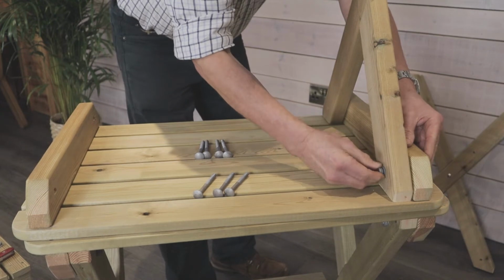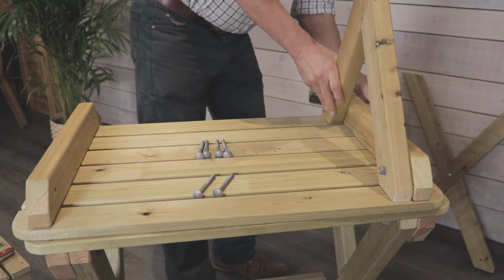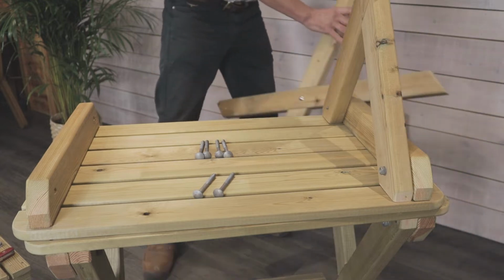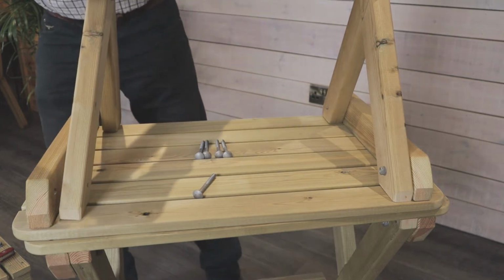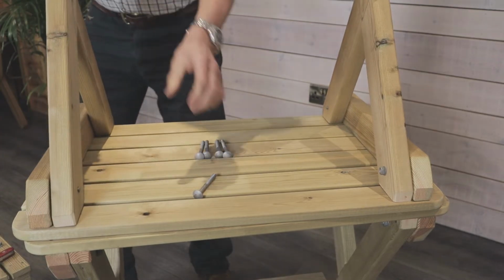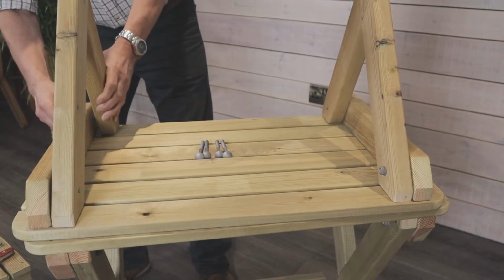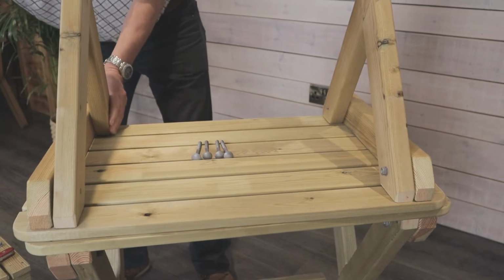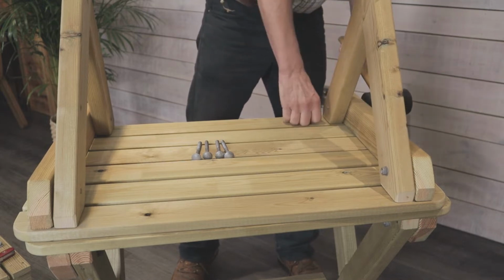Now apply the washers and nuts in any order you like. These need to be loosely finger tight, as you need to have movement of these two units, which will become apparent in a minute. Here I've only fitted one to stop it falling over as I apply all the others. Once you've got the bolts in place, give them a tap with a rubber mallet to pinch them in place.